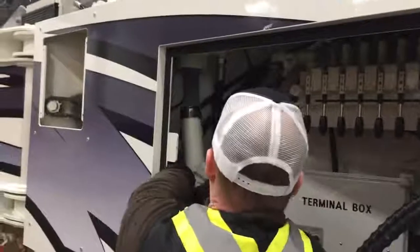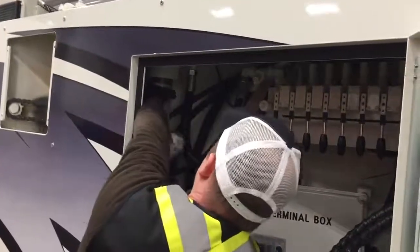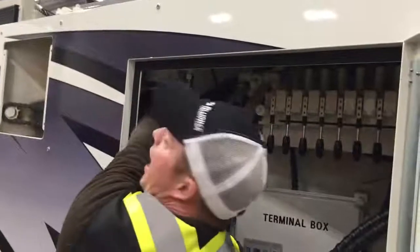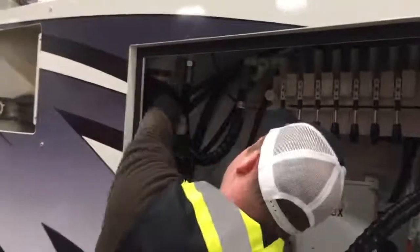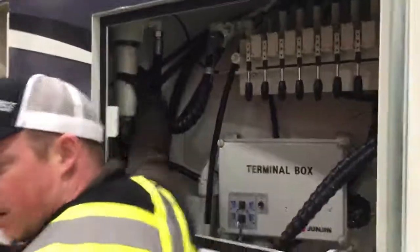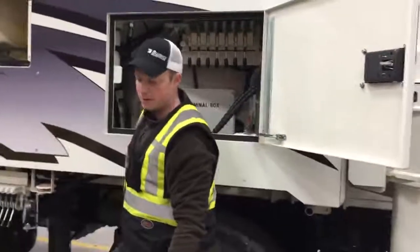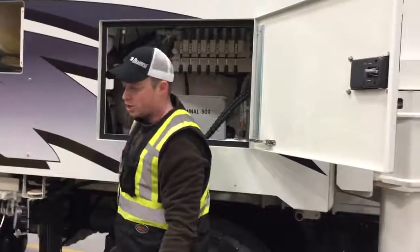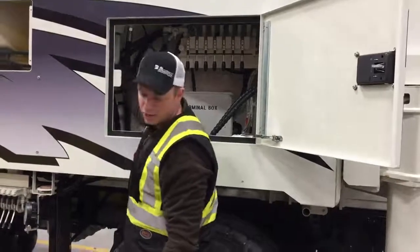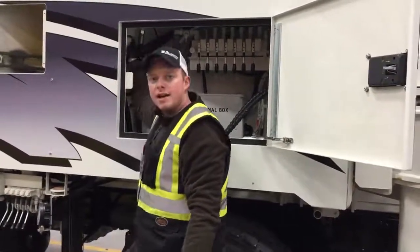The canister back onto the filter housing — sometimes the hydraulic lines are a little bit in your way. I just hand-thread this on until it gets tight enough so I can get a wrench on. The torque on this is also not super tight, so don't use a big bar. Use just a small wrench to get this tight. This unit uses a 27mm socket to tighten up the filter.